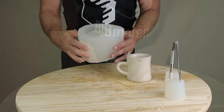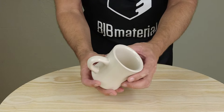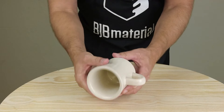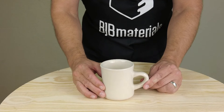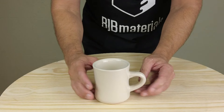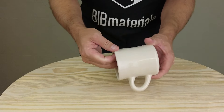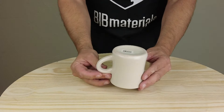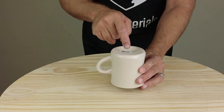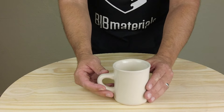What we're going to need to do is plan out how we're going to make our mold. That was one of the important subjects in the original tutorial — the mold theory on a weird item like this that has a lot of funky areas like that inner negative space and that little coffee cup handle. It has a little pass-through there that allows the silicone to communicate on each side. We're going to pour this through the base of the coffee cup, so that's one of the first decisions we have to make: how are we going to configure this cup for our mold?